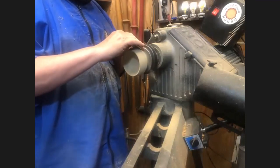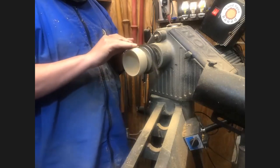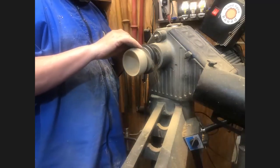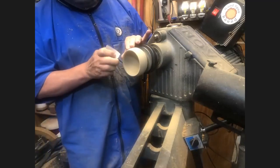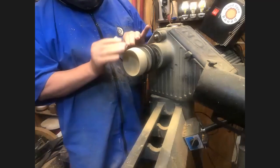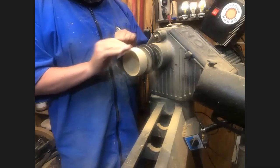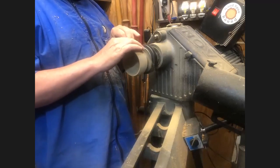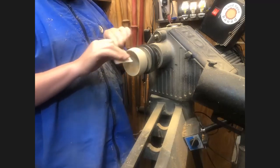Getting ready to change my sanding routine a little bit. 60 grit is awfully coarse, awfully aggressive. I'm going to change my protocol. 80 grit is going to be my bottom, and then I'll go 120, 180, 240, 320. Partly because that works out better mathematically. Russ Fairfield was mentioned earlier, and he always told me everything should step up by half of what you do. So half of 80 is 40. 40 and 80 is 120. So I'll go 80 to 120.